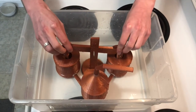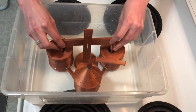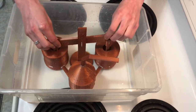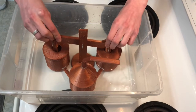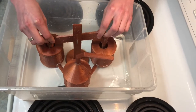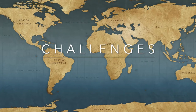Here we see the machine functioning as intended. As each piston arm is depressed it forces water into the main chamber and the valves close behind it, preventing backflow. As one is depressed we see the other piston raise and water is drawn into the bucket. The main chamber fills with water and as it gets full, it ejects water out of the spout on top — the trumpet — where in different circumstances water could be continually lifted or ejected at high pressure as a water hose.